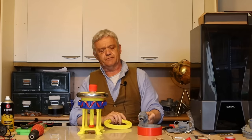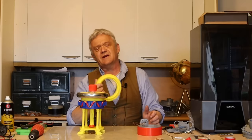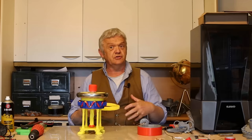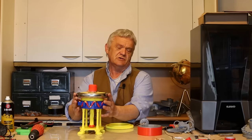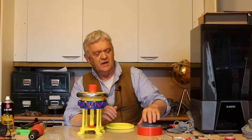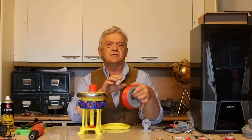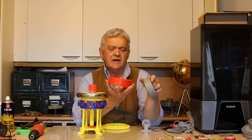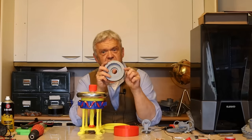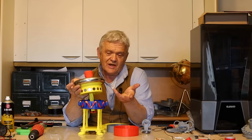To do all of that we're going to adapt this pump generator to include this motor. All of these files I'll put together as a project so that it will be one set of files to produce this kind of generator. This one is already on Thingiverse, but I'll put it together as a separate project so you don't have to go through this route if you don't want to. In order to convert this to run this, the first thing we need is a gear, and then we need to get rid of the magnets and the coil arrangement. This is just a reprint of the carrier but without the little projections to wind a coil, and this is just a reprint of the cap but without the magnets. So let's replace those two things.